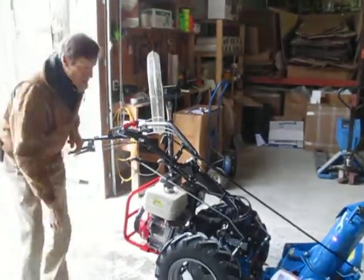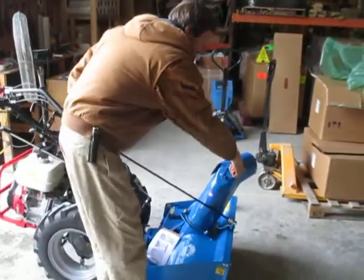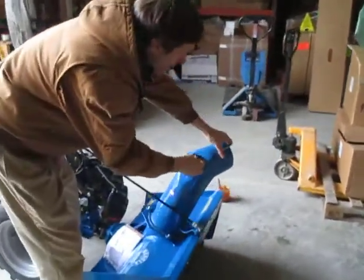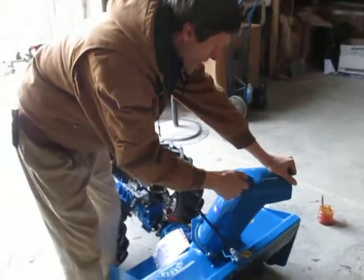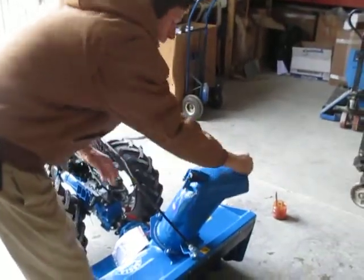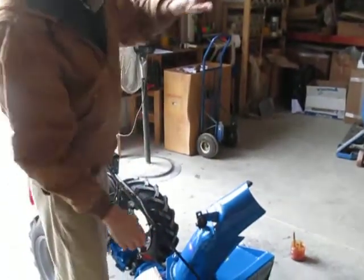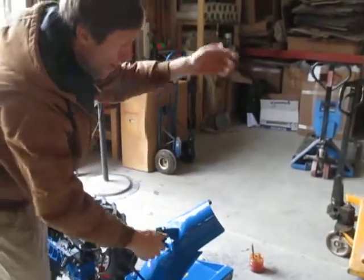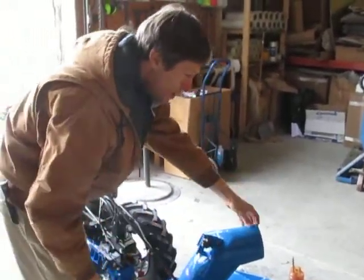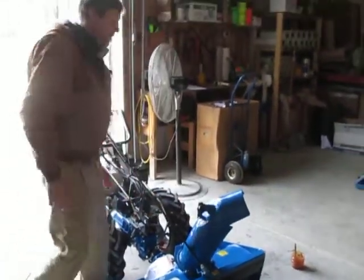You can see how quick that adjustment is. The adjustment on the end of the chute — the deflector — gets adjusted by loosening this knob. You can crank this thing up or down. If you crank it back, it'll have more loft on the snow. But if you need to deflect the snow down somewhat to keep it from hitting a power line or whatever, you can put this down in whatever position you want and lock it into place with this thumb screw.